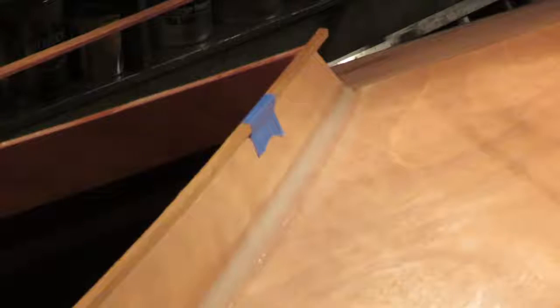Once you get the two pieces close to the right angle, then just holding the piece and rubbing it on a piece of sandpaper works fine. Just a warning though, don't bevel the wrong side. Don't bevel the top or the bottom by mistake. You definitely want to mark it with a pencil before you start to do any work beveling it. It may as well be a fairly accurate mark actually, and then you can cut right to your mark with pencil.